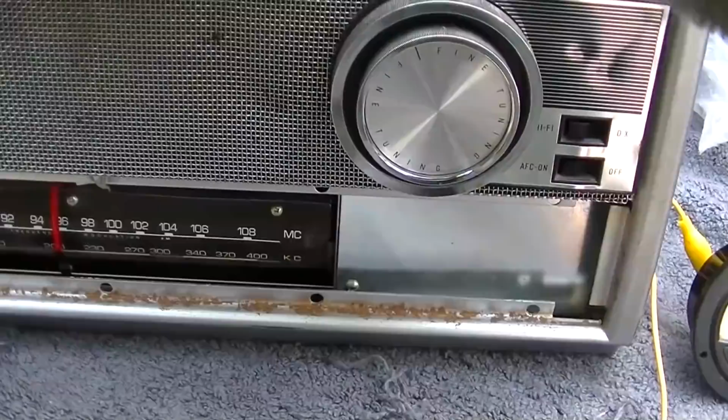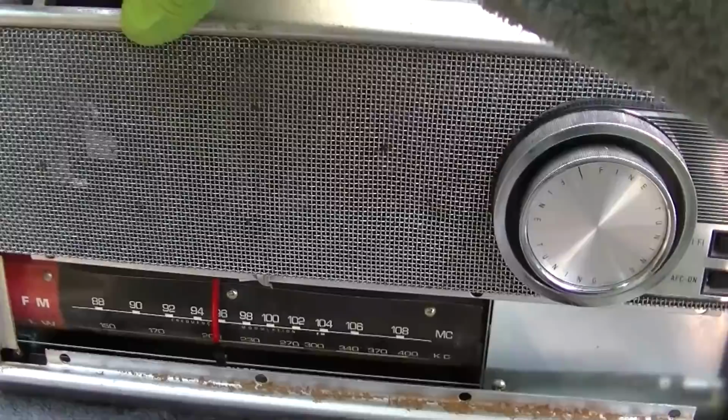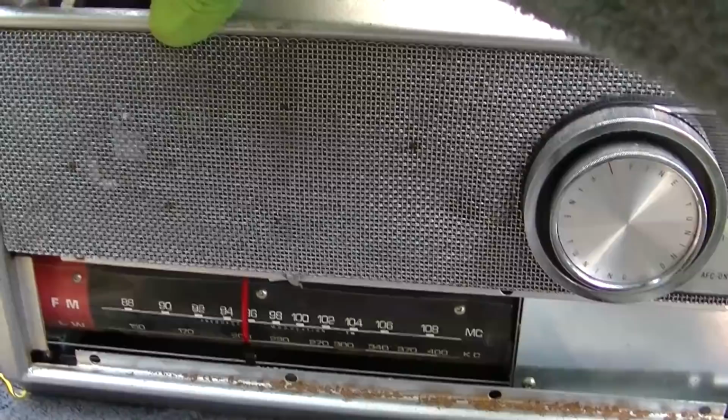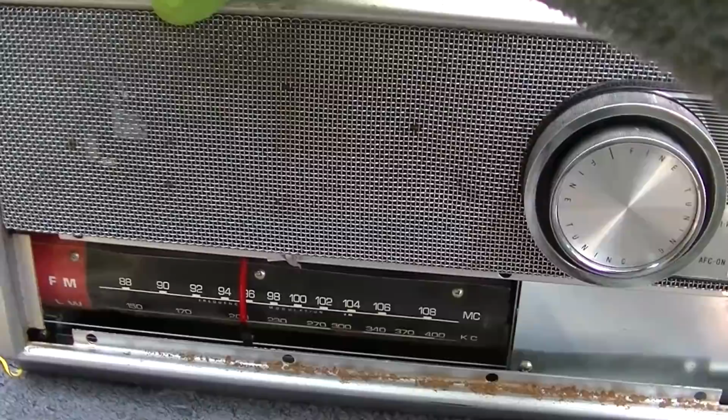It has no lack of power and loudness, that's for sure. I mean, it is blaring loud. And the other good thing is none of the transistors get even slightly warm now. And when I do crank the bias up to where they do get warm, they get equally warm. So at least they're balanced, which the germaniums weren't even close to balanced.